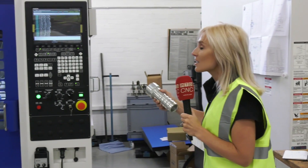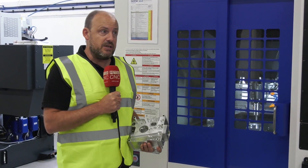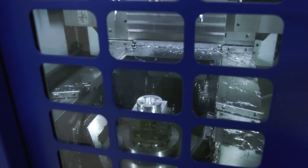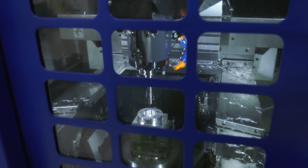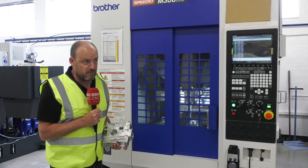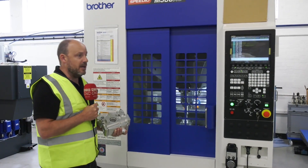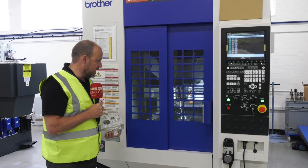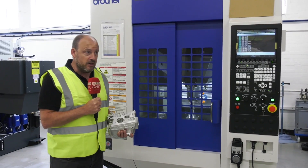I've got some negatives to throw at you — is it going to be as powerful? The beauty of a machine like this, certainly with the X3, is that the turning motor is very powerful. One of the things people often say when looking at turning centres is that the milling capability isn't as strong and robust as a machining centre — and that's true, it very rarely is. Whereas here you've got the turning power, but you've also got a spindle taper on this Speedio machine that is more than capable of milling stainless steels, titaniums, all kinds of different materials.